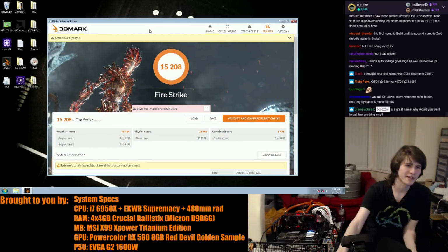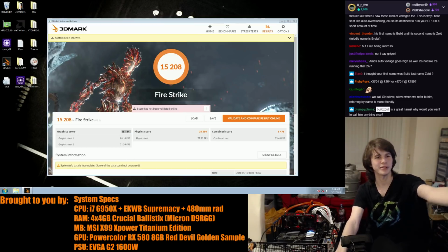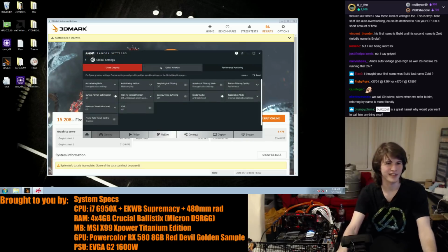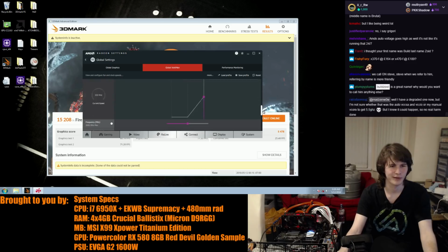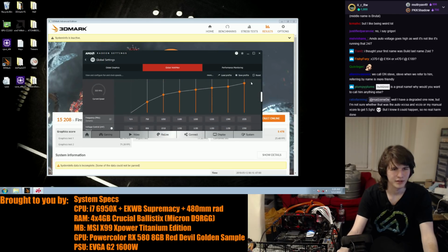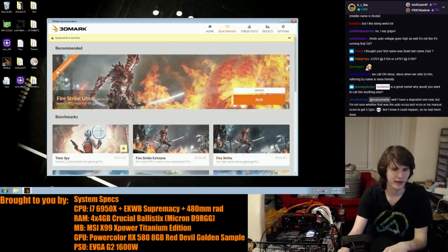Yeah, okay, so we've made zero progress. Zero progress, because the memory timings are tighter, but the memory clock is lower. And the core clock is actually higher, so we've lost performance because of the super, super low memory timings. Okay, let's see if we can run a bit more memory clock to fix the timing situation. But I think I might have to revert back to the 1625 memory timings.